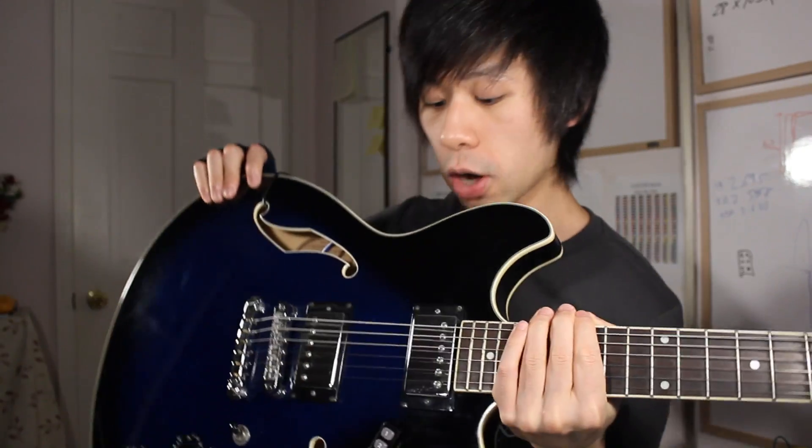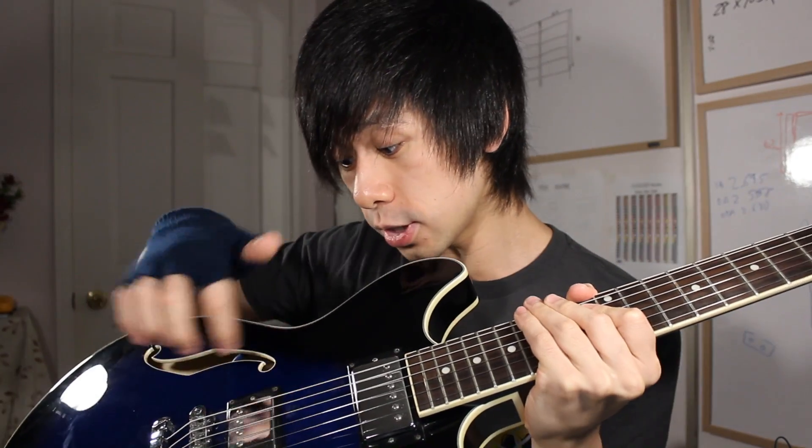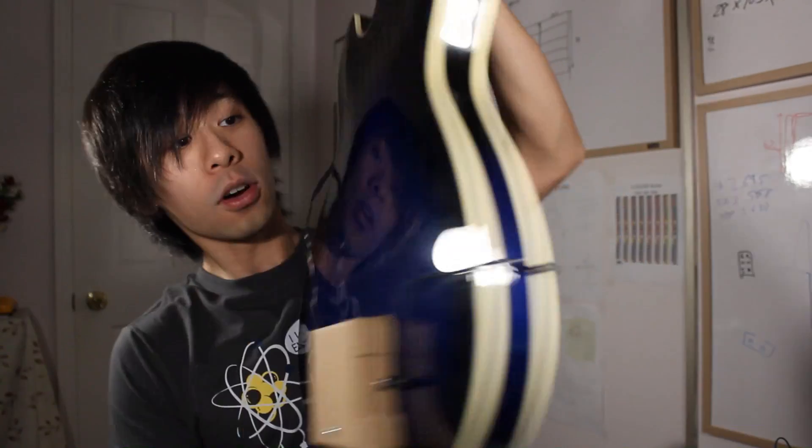Here's how it all works. You remember that Arduino project we had last time - the metal detector? Well, here inside my guitar is a detector coil, and my mitten is lined with tin foil. The detector detects the proximity of the tin foil and sends a signal over to an Arduino in the back. The Arduino then sends a MIDI slider signal out the MIDI jack. Full schematics at the end of the video.